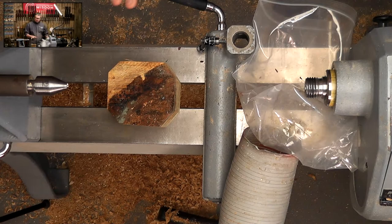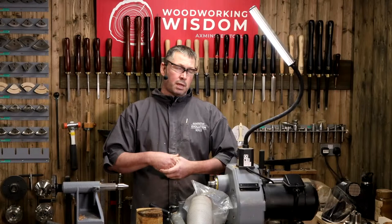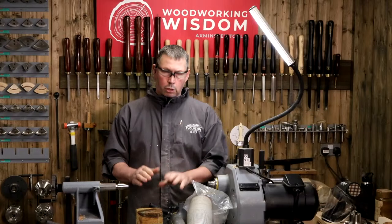They will last like this. Even in a plastic bag, you can keep them in there for, I'd say, 6 weeks, but you would need to keep aerating them to get rid of that mold. You can put them in paper bags with shavings, all those sorts of things, but the same thing: you need to keep turning them over. It's not a long-term strategy. It's a short-term strategy until you either rough turn or thin turn, which we're going to talk about today.